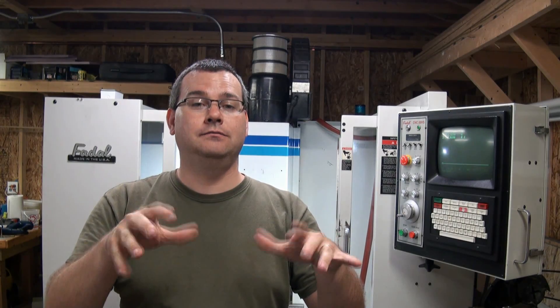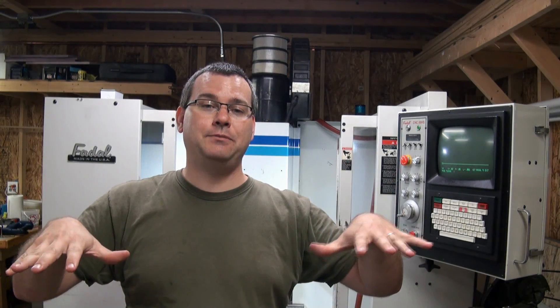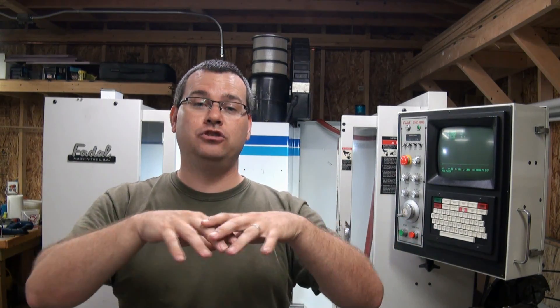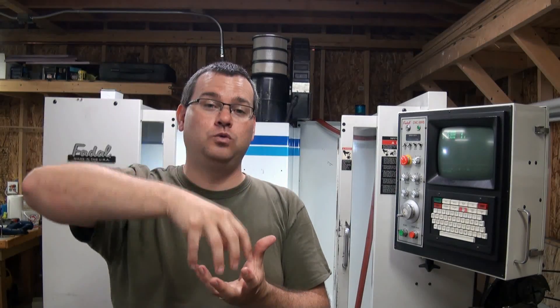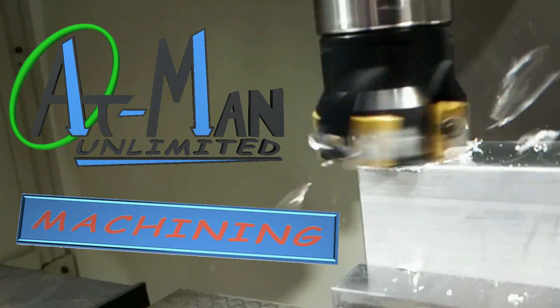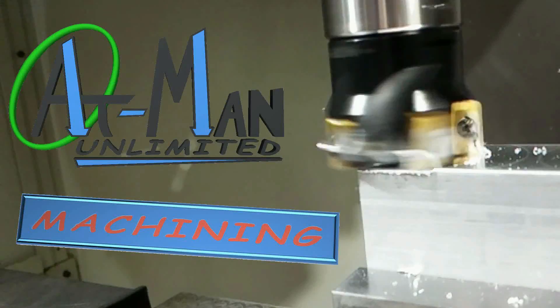I hope you're enjoying our videos on how to align and do machine maintenance. In our next video, now that we have our table squared away — pun intended — we're going to work on the Z column. We have everything done on the table: we have a good datum, it's straight, it's true, it's square. Now we have to make sure that our tools coming down to our parts are the same way. Join me again for another video on Z and we're going to talk about how to align Z. We'll see you next time.